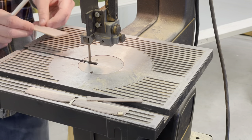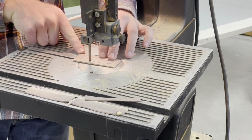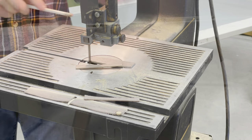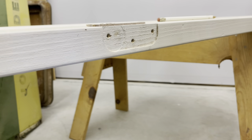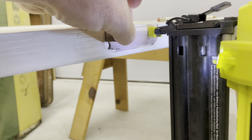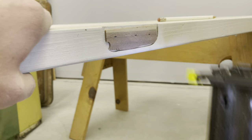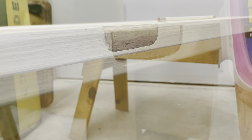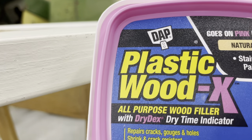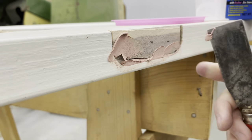You could also just break these shims by using a sharp chisel, but be careful whatever process you choose because these are fairly small pieces to work with. I'm going to attach the shims to the door — you can now see how they fit into the grooves for the door hinges. I'm using my nail gun to attach these, but you could also just use glue and the painter's tape clamp trick. Here I'm using Plastic Wood X All-Purpose Wood Filler by DAP to fill all the extra spaces and make the shims level with the rest of the door.